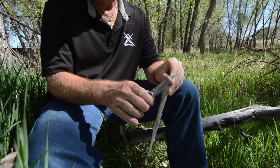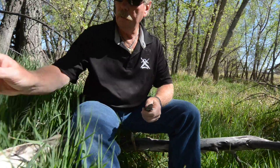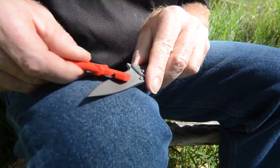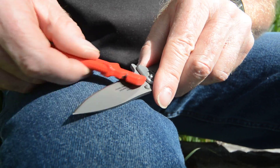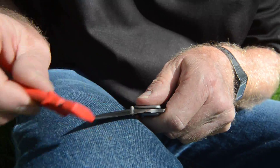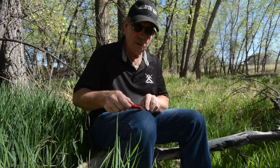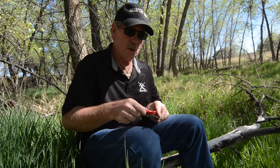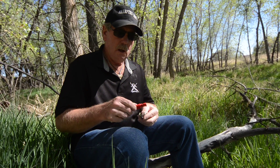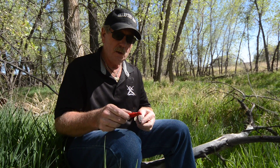That isn't too bad, but you do have to coax it lightly, ever so lightly. We just touch along like this — about a 12-degree bevel on each side of the blade, comes out about 24 degrees. You'll be a little bit off one way or another, but we're only talking probably one or one and a half, possibly two degrees. You really kind of got to get carried away to change it very much. Then we just brush it lighter and then real light back and forth, going to touch it about 20 times. You guys watching the video, you tell me when to stop.